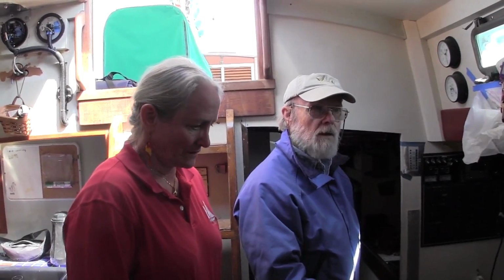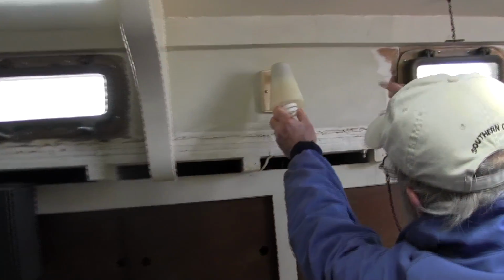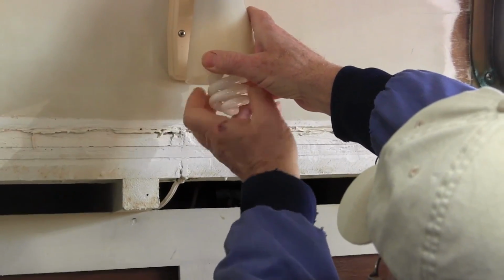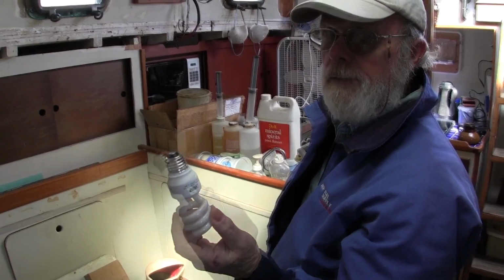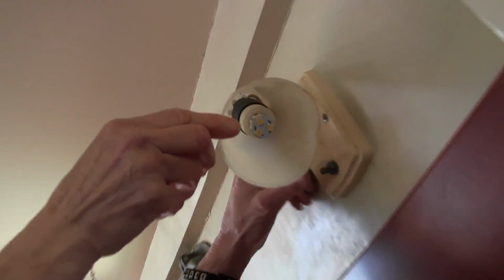Right. We did fluorescent. We've got a fluorescent here. Oh, yeah, very nice. And it says red too. There's the red. These cabin lights actually have an Edison base, but they're 12-volt bulbs. They were incandescent bulbs that were 25 watts. And then we replaced those with these, which are 13 watts and twice as bright. And now we're working on this side, it's too bright in here for you to see how. LED. So that's 4 watts. And that makes as much light as this.